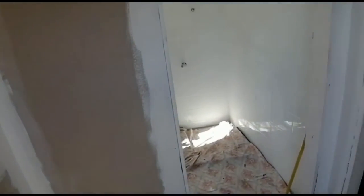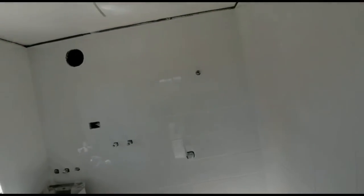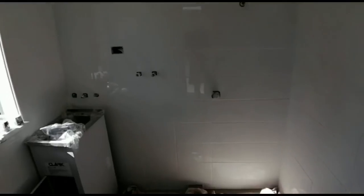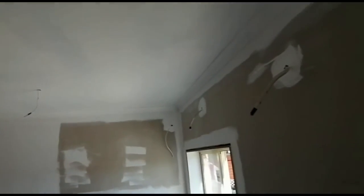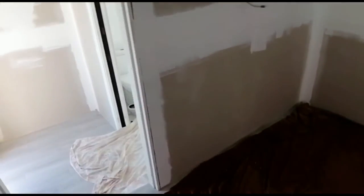Another update — tiling is finished. Fully done, grouted and everything. Started doing undercoat everywhere. Unfortunately ran out of undercoat, so gotta go buy some more. But yeah, looking good so far. It's only the first undercoat — probably do another two, so three undercoats in total, I think, because it seems to be sucking it in. And then paint the colour.